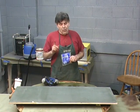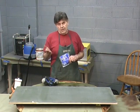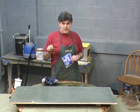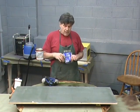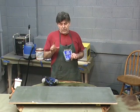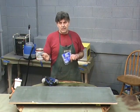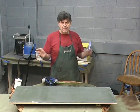except you've got all the problems. Now, one of the things you're going to see out there, and I've mentioned this, is that you're going to see finishes tell you do not thin. And the reason for that is we have this VOC thing. Now, this is solvents I'm predominantly talking about. VOCs is volatile organic content, or how much nasties is in it, sort of. And I told you HAPS, H-A-P-S, stands for hazardous air pollutants. Now, the reason they tell you don't thin is that when you add thinner or solvent to it to reduce the viscosity, you added more VOCs. And it will exceed the level that the government says is the maximum that it can.